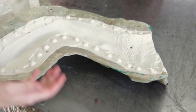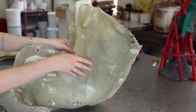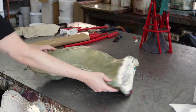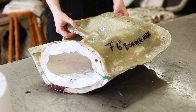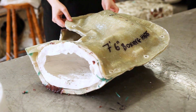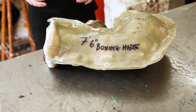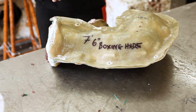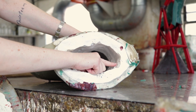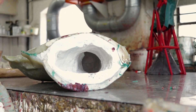This mould is a two-piece mould. These two sections come back together like so. It's quite sturdy with drilled holes in it so that there can be nuts and bolts drilled through, and it's squeezing the rubber incredibly tight so that you don't get seam lines. Where the two pieces join together, you'll get a little bit of extra wax that seeps through the edges.